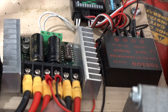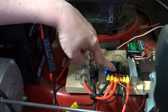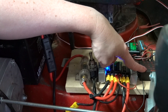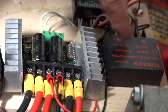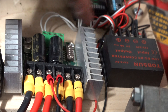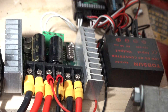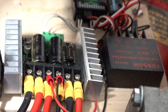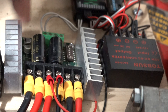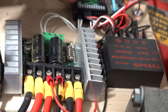The motor driver takes the battery input and gives power to the appropriate motor based on the signal from the remote receiver. There are two small sensor leads that read voltage from the battery — they also power this step-down converter. This step-down converter converts 12 volts to 5 volts for accessories. The step-down converter provides an alternate power source other than the motor driver. If something were to happen to the motor driver — if it were to short out or experience flyback voltage, which can happen if you have large motors going forward and then suddenly stop giving them power — the voltage can spike back through the system and short out the motor driver momentarily, which would also short out the remote receiver and prevent it from interpreting signals from your transmitter, potentially causing loss of control.